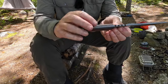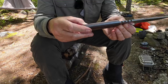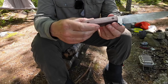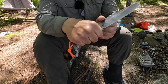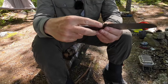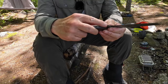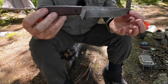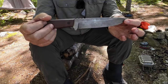The high saber grind and the fine secondary edge are combining to make a better-than-average feather sticking knife for this size especially. The comfort in doing so — personally I would like it to be a little thicker through here, but it's comfortable and well-radiused all the way around. The guard is still giving me some issues when I have it up close, but I think that's easily fixed with a Dremel tool just around that guard so it doesn't have that sharp 90-degree spine right there.